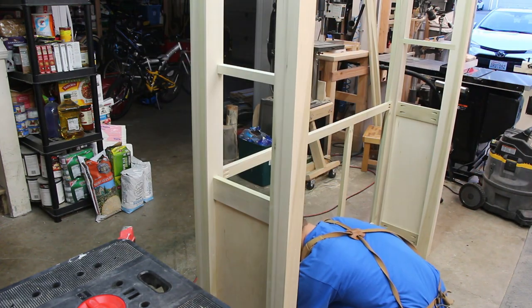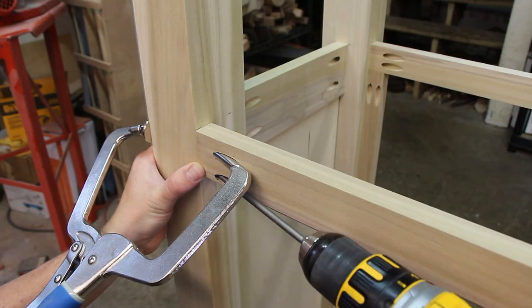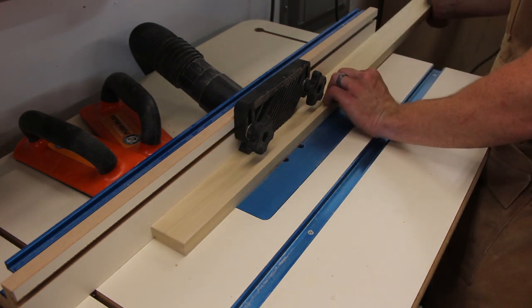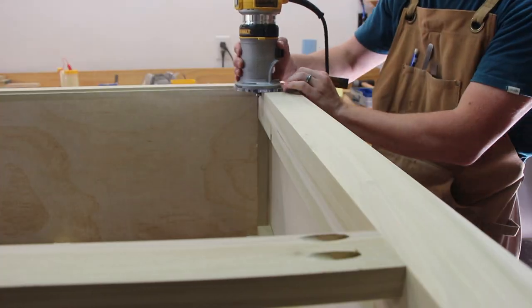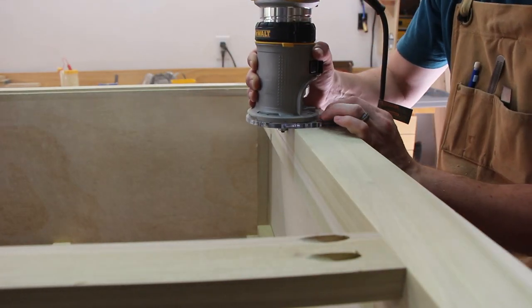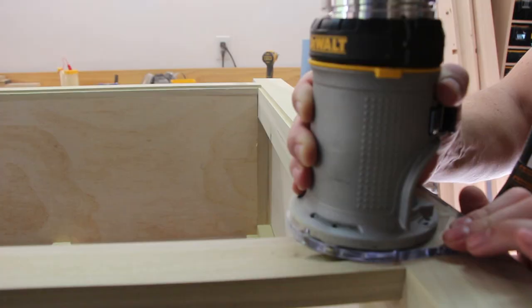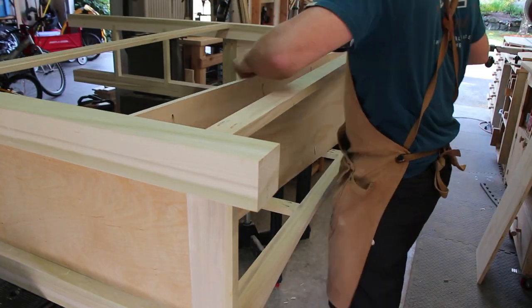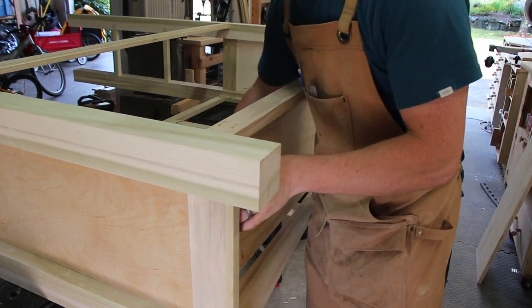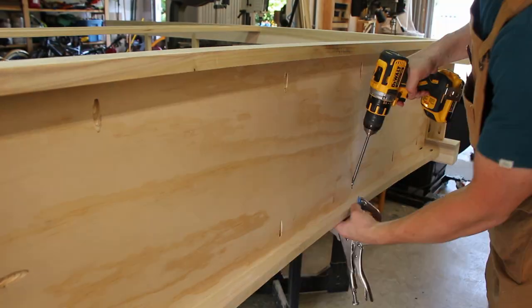On the back, there was also a cross piece on the top and bottom of the cabinet. This piece needed to have a quarter inch rabbet cut around the perimeter for the back panel to sit in, so I laid the entire bookshelf down on its front and routed that out. The base of the cabinet and the cabinet shelf were three-quarter inch plywood cut to fit inside the frame, and the base was held in place with pocket screws around the edge.